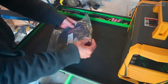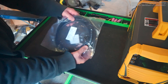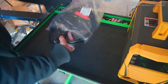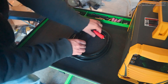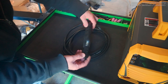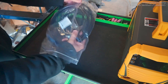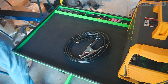Next we have the argon line, which hooks up to your regulator or flow meter on the argon tank directly to the machine. Here's the arc welding torch with a 10 foot cable. With stick welding the machine can switch between DC positive and DC negative depending on what you're working with — this involves switching the position of the wires at the front of the machine. Here's the ground clamp, also 10 feet in length, and both sides of the ground clamp are grounded.